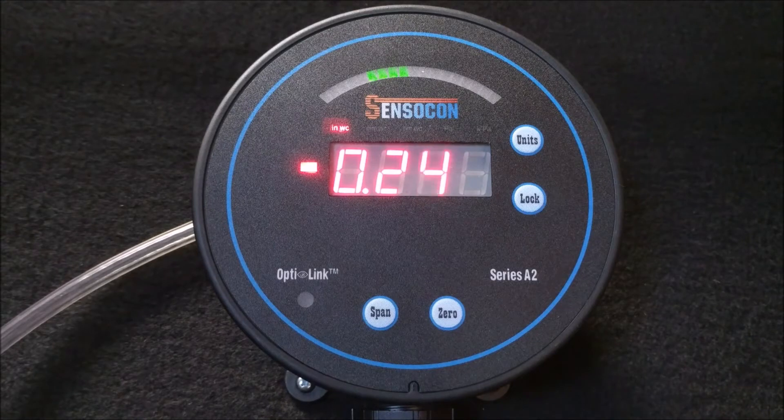In this version we modified the process arch to start in the middle of the gauge and go to the left with a negative pressure and to the right with a positive pressure. All of the LEDs on the left side of the arch are green, which represent the room in a negative pressure condition, which is good. On the right side of zero the LEDs start yellow and go to red, indicating a positive pressure situation.